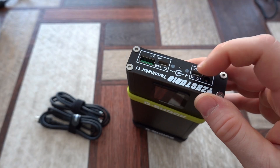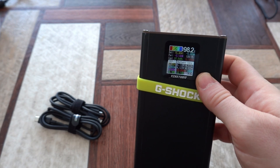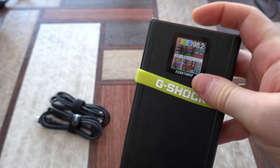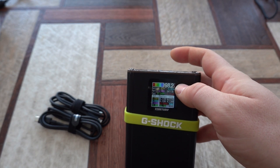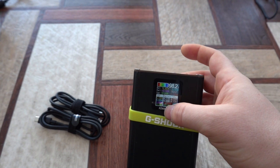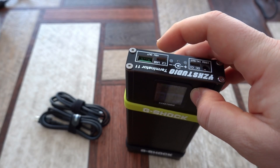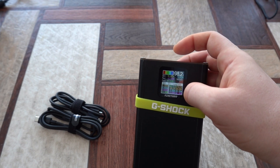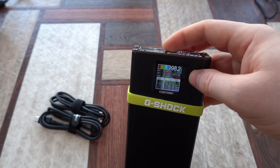This device can take up to 150 watts of power on input and provide the same on output. Let's turn it on — just click once on any button and you get this screen, which is quite informative. On the main screen we have battery info and a general section with additional information about capacity percentage, power consumption, and average time of usage. On the left side of the screen we have some info — call it DCP — and if we connect an external device to this port, the DCP will show us the load.